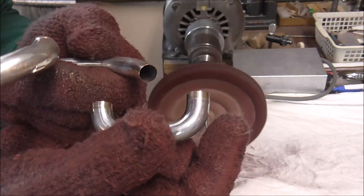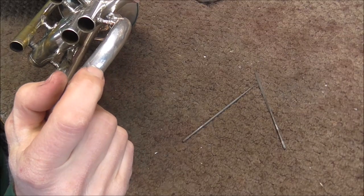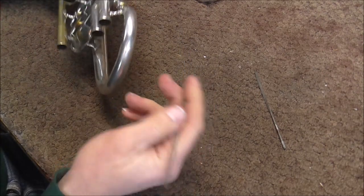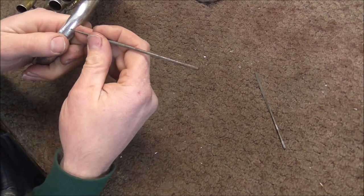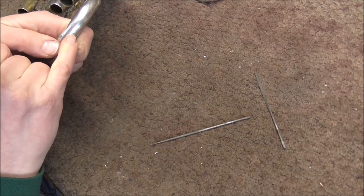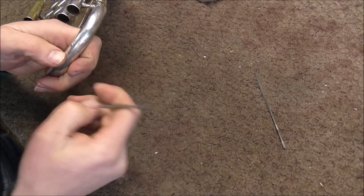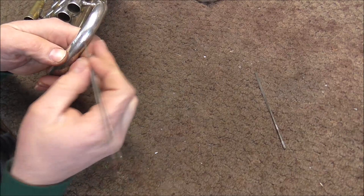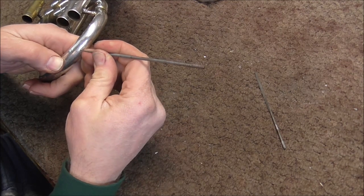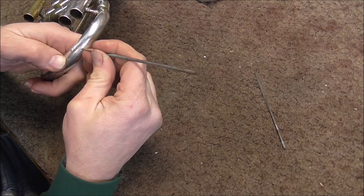I got all of the solder off of there — at least the solder that is near where I'm going to need to heat it up very hot. I'm getting ready to solder these cracks now. Solder cannot stick onto dirty surfaces, so I need to make sure that there's clean metal for it to stick to. I have these little needle files, and I'm going to use those to clean up these cracks. I need to clean up inside of the cracks too, because I want the solder to stick inside so that when I file it down, it's level with the surface of the tubing. If it only goes on top, I'm just going to have a blob of solder. I want it to look neat, so I'm going to try to get inside of the cracks. This does make the hole a little bit wider, but that's okay because I'm going to fill it up.